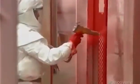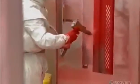All the parts now head into the factory's paint shop. The powder paint they use for this model contains electrically charged silver particles, a natural disinfectant that kills any bacteria, viruses, and fungi on the locker surface. Once coated, the parts go into an oven for a half hour to bake the paint.